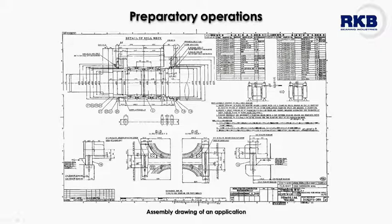The first step of the mounting procedure is to read carefully the requirements indicated by the designer of the machine in terms of rotating speed, bearing radial and axial clearance, lubrication method — grease, oil, oil-air, oil drop — and lubricant characteristics like its origin (mineral or synthetic), the type of soap and extreme pressure additives used, its overall physical and mechanical properties, and its rate of resistance to water, temperature, and metallic and non-metallic contaminants.